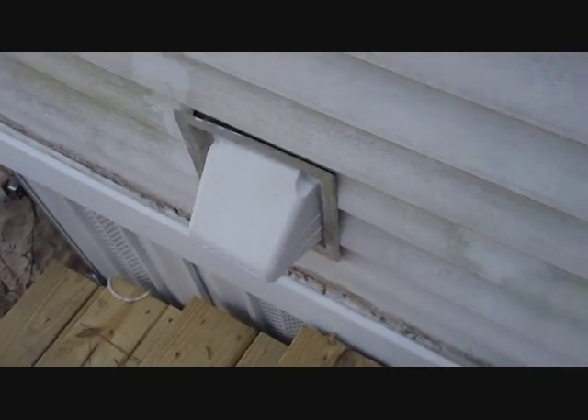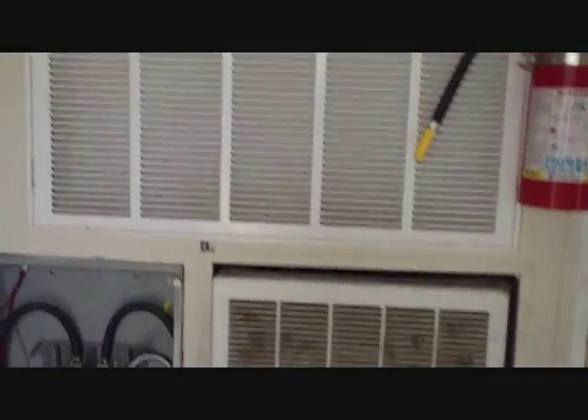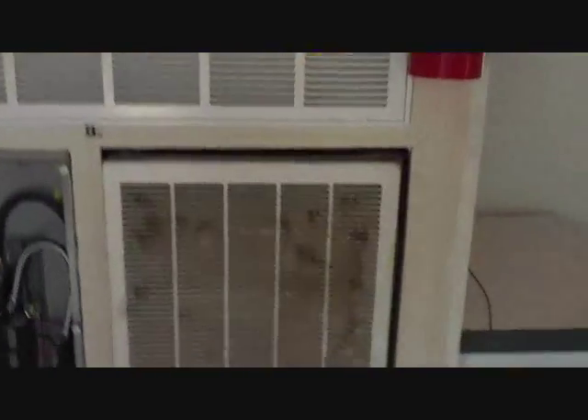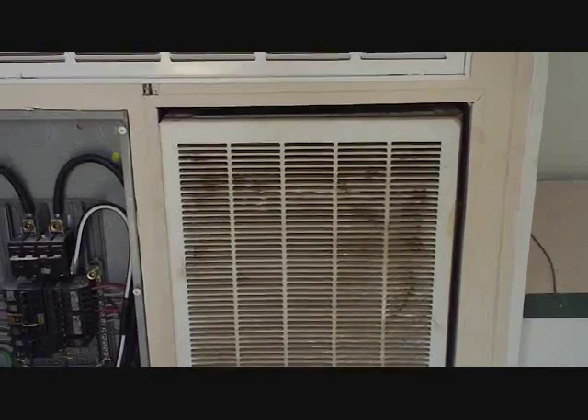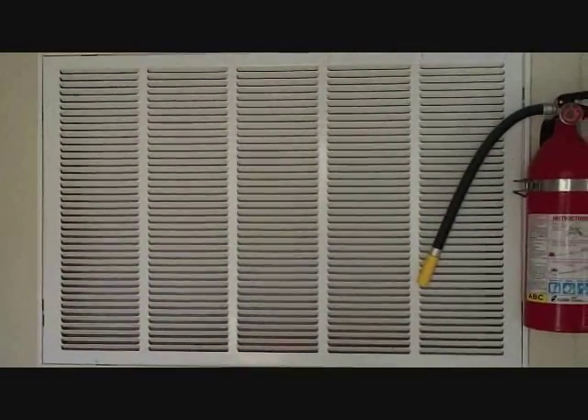We got our dryer vent in right there, which is easy since it just goes right there. I installed a new 30x20 filter grill. We're going to box this off — right now it's sitting open, but we're going to box it off, create a door, and make that area behind there into a plenum so we can pull air right there. There are so many cracks around these furnaces, and even though we're using that back area as a plenum, I think it's still tighter than using the furnace itself.